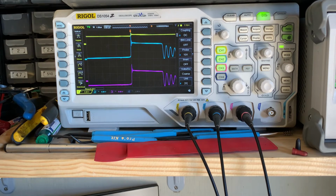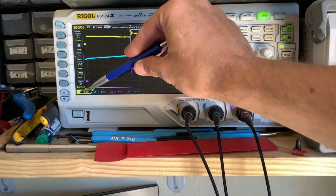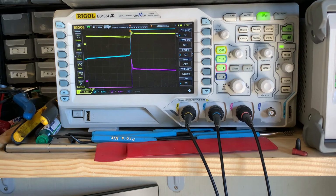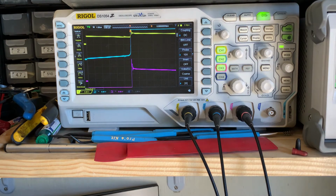To all intents and purposes, we are boosting the circuit. We'll go to 4 volts, 5.3 to 5 volts, 5.4. So basically from 3 volts we are already regulating. I'm going to step it straight up to 15 volts. And what you can see is our output voltage is pretty well regulated. So I'm sitting at 15 volts on the power supply side that I'm supplying into the circuit. Remember, we're not driving any load yet, we're only driving the LED.